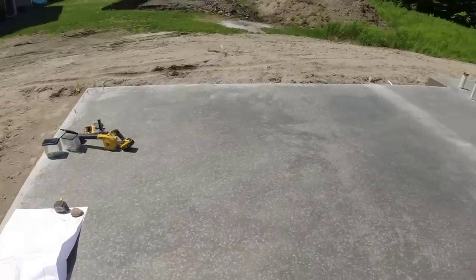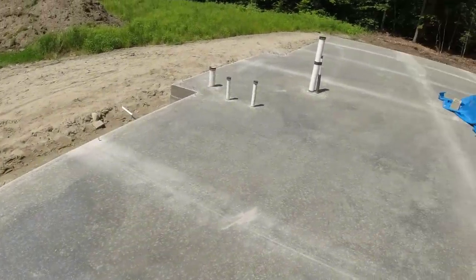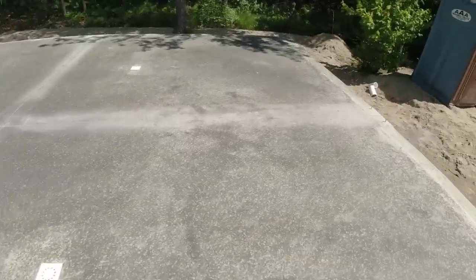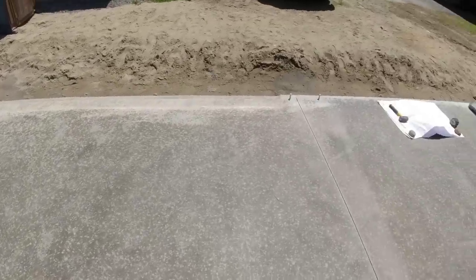All right, that does it. So we got all our anchor bolts in. We ended up using 48 of them around the slab, 70 by 40, about every 5 feet. If he wants to put more in, he can. But that's gonna help anchor down his sill plate, and then obviously he can build his walls on top of that.